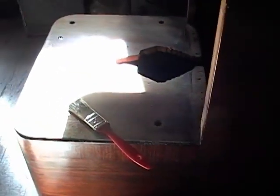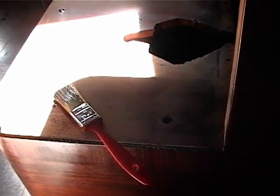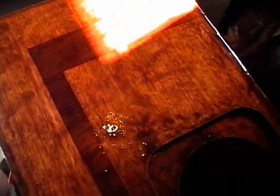Down here I'm just going to sand the existing veneer down so it's nice and flat. Patch in the hole and I've got some new veneer I'll be applying. The rest of the cabinet I'm going to strip. I had thought about trying to just spruce up the original finish, and on the sides it's not so bad. But the top had some real blemish and flaking finish issues. It was darker in some areas, lighter in others, and it just didn't look that good. So I'm going to strip it.